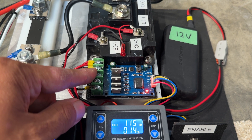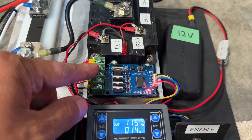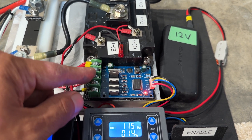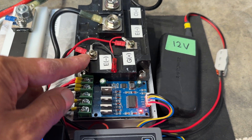This amplifier is a full H-bridge so it has transistors to turn on the 12 volts as well as the zero volts — it's slamming on and slamming off to ground. That drives this IGBT very quickly.